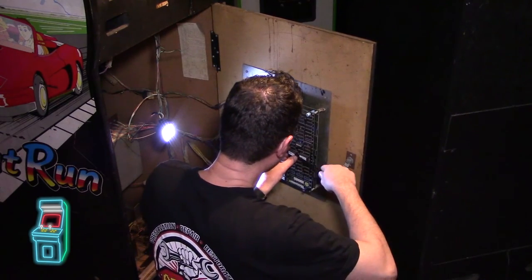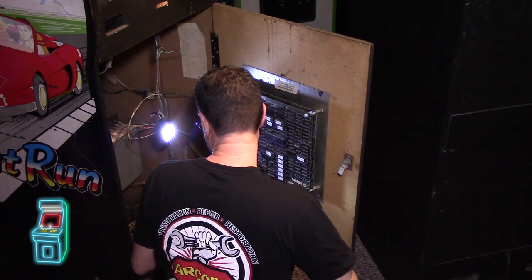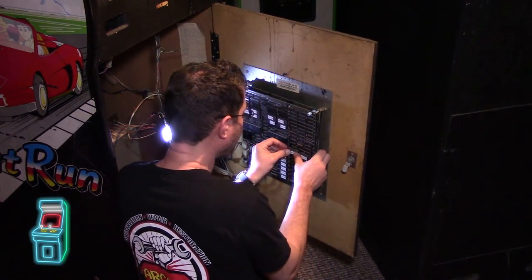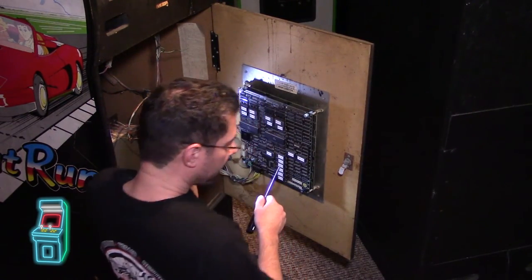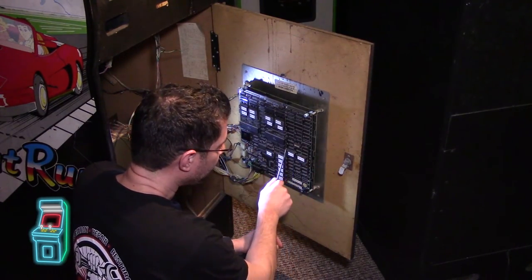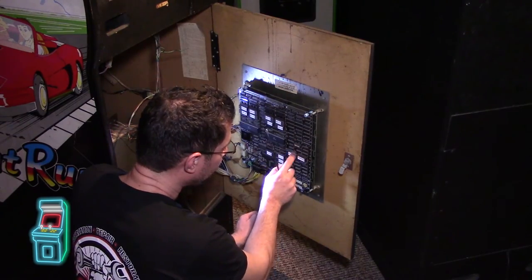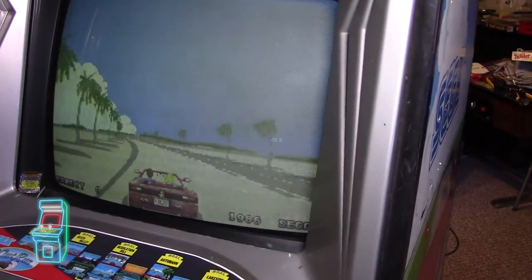Actually, let me take one out because I wanted to show you guys half the road first. So 10186 would be this one here. The one on the left is the incorrect one and the one on the right is the correct one. Let me fire it up and you'll see the road on the right has data, but the one on the left is looking for data that's not in the correct place because it's burned incorrectly — it'll look weird.